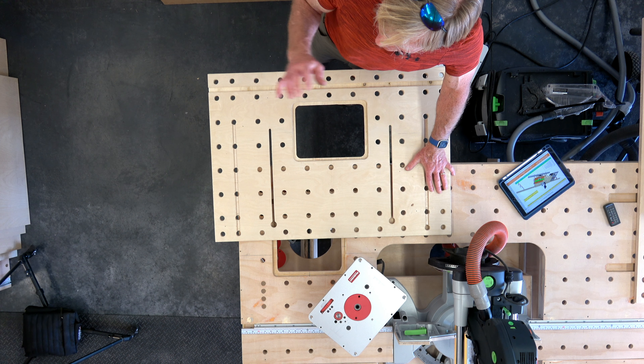The change is pretty small. These dados here cut through these 20-millimeter holes are set so that the clamp will be below the surface when you clamp it to your workbench. This router table will work with the Smart Total Station or the compact bench and any benches I design, because all the holes are cut on the same industry standard pattern of 20-millimeter holes, 96-millimeter spacing from the edge, in both directions, with an additional row of holes 32 millimeters in from the edge. So this top is essentially a mini version of the top on any of my work benches.